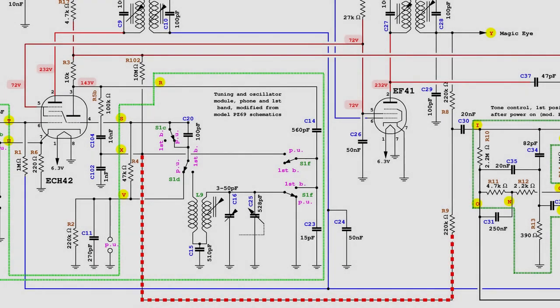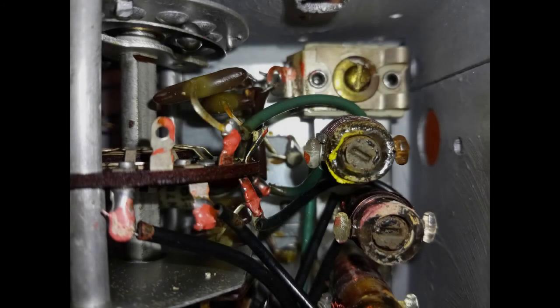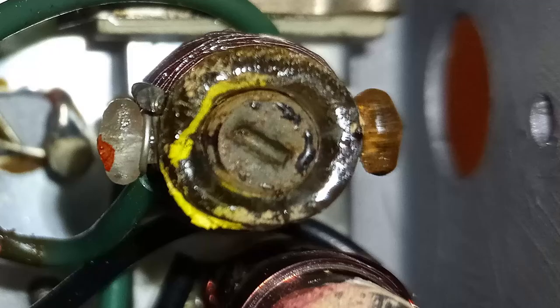Finally, the culprit is found. The connection marked on the schematic with the dotted line was missing. In this radio, tar has been used by the factory to lock the cores in the coils. It has been possible to move only the intermediate frequency transformer coils, to tune them to 470 kHz, heating them up with a hot air gun.